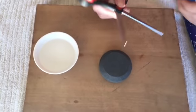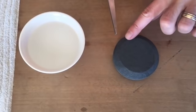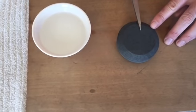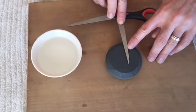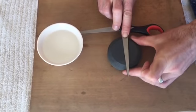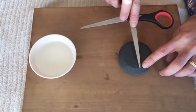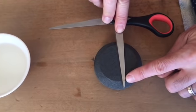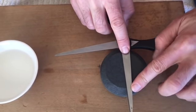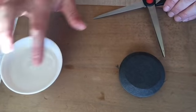The process is very simple. Please note that with the Lansky Puck, one of the advantages is that it has several angles. As we sharpen our scissors, we're going to want to keep our blade flat against the angle of the stone for the entire pass. Also note we will not be using the front of the Lansky stone, because once we meet resistance there we can go no further. So simply take a bit of water to moisten your stone.